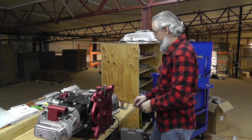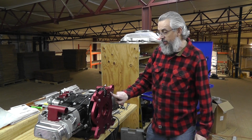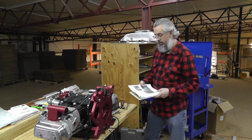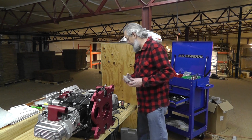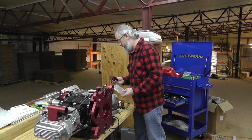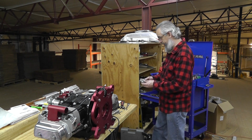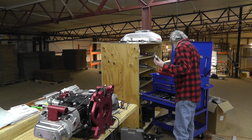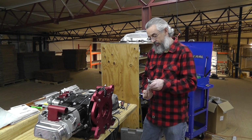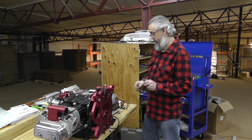All right. Primary ignition timing is set because it's fixed. So next step is, I believe, the trigger shaft installation. Pretty simple. Nine-sixty-fourths hex drive. Do we have one with us? Metric. Sure, I brought up metric tools and now they want SAE. What do we got here? That works.